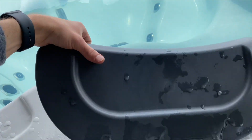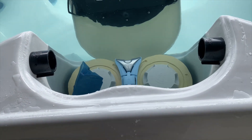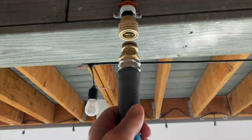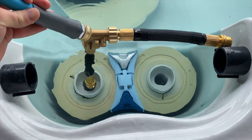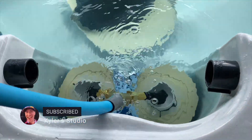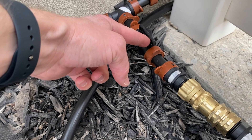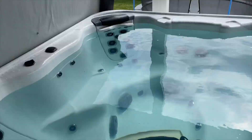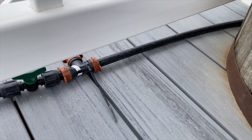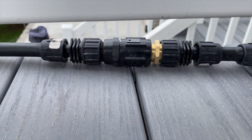This is a very specific use case, but you can use the same concept to hook any sort of garden hose. Say you have a pressure washer and want to wash different sections around the house without dragging the garden hose all the way around. You can have a high-pressure section of your drip system give you high pressure or more water at different sections around the house before reducing the pressure for the drip. I use a short hose to a Y to put the water into both of these filters so I don't have any airlock when I fill up. I put a valve on the front section, so if I'm filling the whole hot tub I can close the valve in the front and open the valve in the back — shutting off all the low-pressure sections and using the high pressure. From the high-pressure drip system, I come up on top of the deck through a valve, and then through a series of couplers and another 25 PSI pressure reducer, I'm back to my 25 PSI poly.